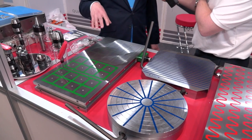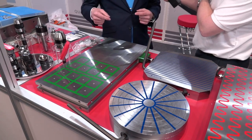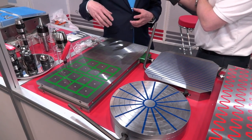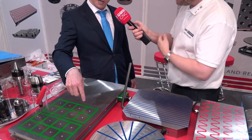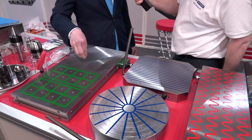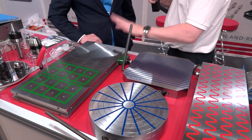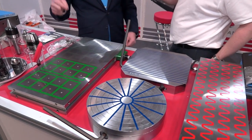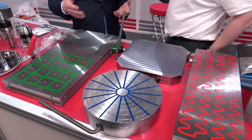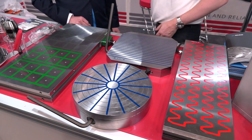The top plate is made of a solid block of steel, and what it does is prevent cooling liquid from getting inside. Sometimes customers use very aggressive cooling liquids and the temperatures involved are quite high, so the resin that isolates the poles can crack and cooling liquid gets inside. That doesn't happen with this one, meaning the electromagnetic holding lasts a lot longer and you prevent the magnet from failing altogether.